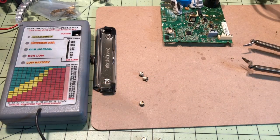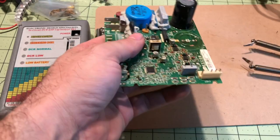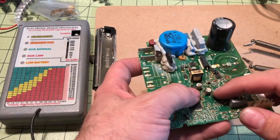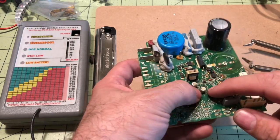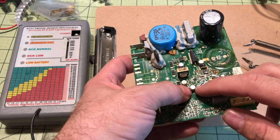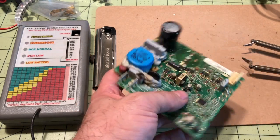And I'm going to show you how I figured out a way to take these out without damaging the board. Because these are surface mount, they're a lot more susceptible to overheating. What was happening was I was using a regular iron with a fine tip, but when I would pull one side up, it would damage the other pad, and that's why I was having problems.